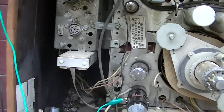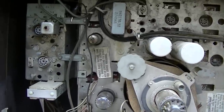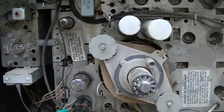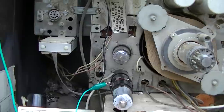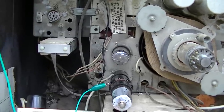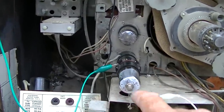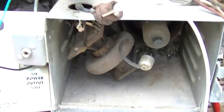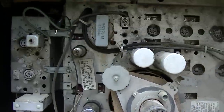The horizontal works, the vertical works, power supply, and the video works. You can drive a straight composite signal into it and skip the IF and tuner, and the set will produce a picture. But we've got a problem here with the horizontal — it could be a shorted yoke, a shorted capacitor — something's not working right. It's drawing too much current. I disconnected that and it's not that. The flyback doesn't look like it would be bad, but looks don't tell you much. The chassis has to come out and the boost capacitor and all the other filter capacitors around this circuit need to be checked.